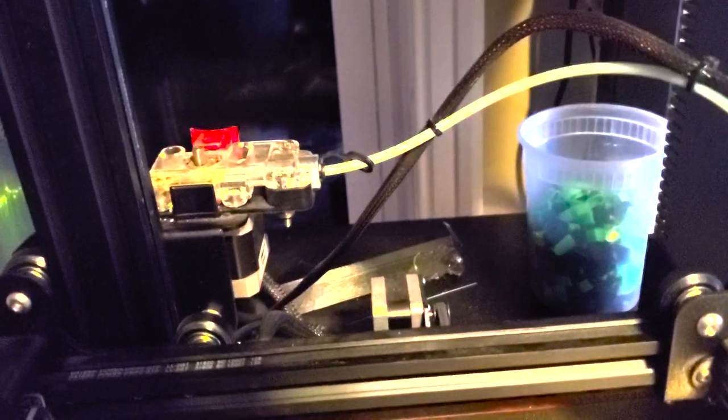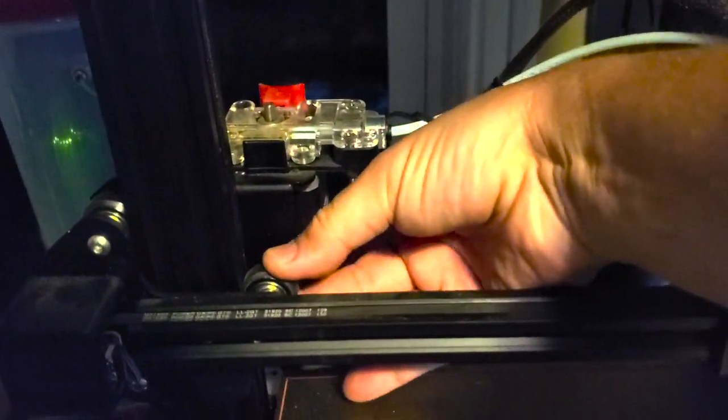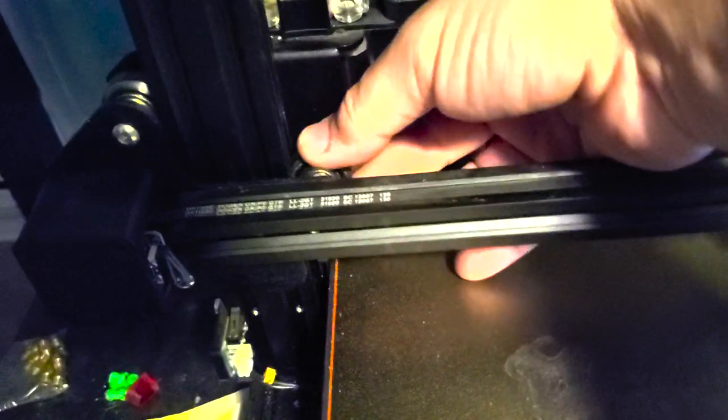Then next thing to do is more rollers. You got a roller on the inside here and around the back here is this coupler, and you can easily use your fingers to bring it up and down. So let's see if I can do this with two hands. I can't, I've only got two hands. But you're basically going to roll it up and down with one hand and then grab the wheel with the other hand and make sure that there's no slippage. You can see this thing ain't slipping. It's going to move the whole head before it slides.